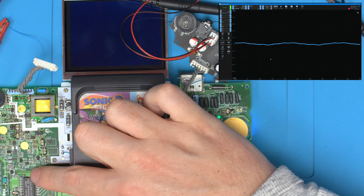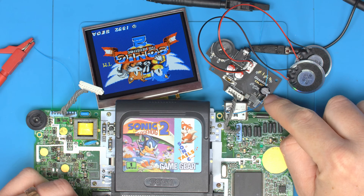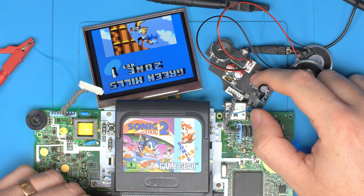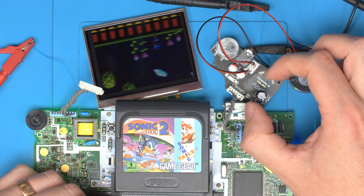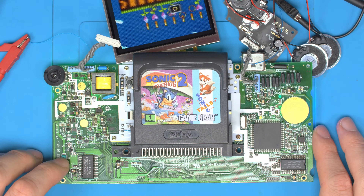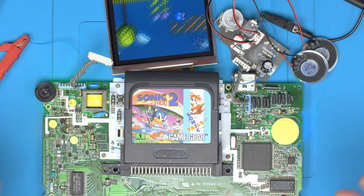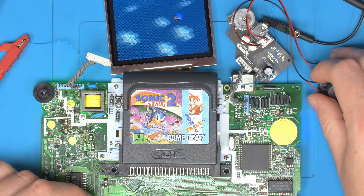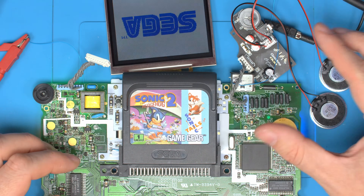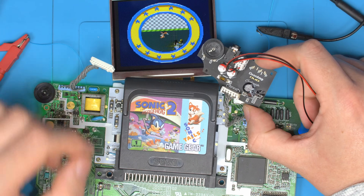Before this goes into production, I've got to improve the capacitance on the 5-volt rail on the Clean Amp side — I'll just put a few more caps on here, as these are headphone caps, not amp caps. I'll also test a bunch of inductors and scope them to find the smoothest 5-volt rail. I'll confirm all the audio frequencies and stereo work with frequency analysis and scopes, and then I can pretty much package this up ready for sale. And of course I'll test the headphones too.